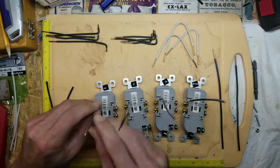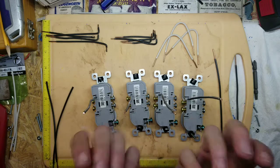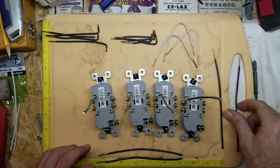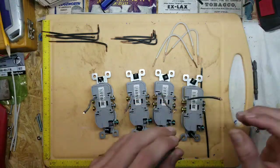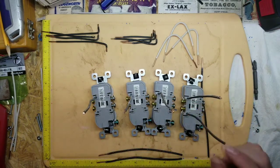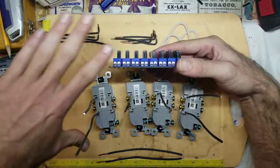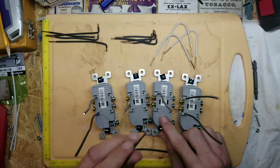The outside wire gets the longer one with the double strip. Push and wiggle it in. Now why did I use double-stripped wires on top? When I put these through the box and they come out the other side, I won't know which is top and bottom. The double-stripped ends on the bottom will differentiate them — it'll tell me this one is on the bottom, that one is on the top. The long wires on the outside help when connecting to the relay boards — those long wires will connect to your relays.